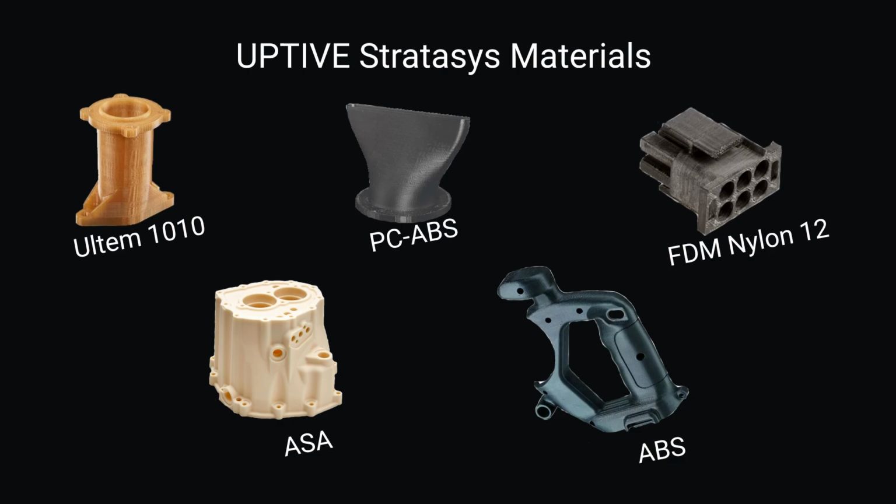So I'm going to start with our cheapest material option for the Stratasys machines. Those two are going to be your ASA and ABS. With ASA and ABS, very similar, the only difference is that ASA is acrylic based, so it's going to be better for parts that are going to be exposed more to UV, because the acrylic is going to have more resistance to that, to not have the color faded. Whereas the ABS is not going to have those properties to combat that. We have a lot of different color options too that Stratasys provides. We have black, yellow, red, green, every color in the spectrum that you can imagine. So if you're looking to do a quick, budget-friendly prototype, definitely ASA and ABS are going to be your go-to materials for those applications. You can use them for housing, for toys. They have pretty good properties for those applications.